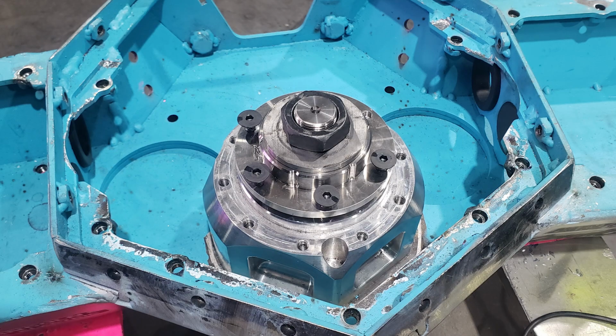So, my face, when this all happened, that is a meme now, and, like, what do you do? Every single thing has gone wrong in what was supposed to be our breakout season with what was supposed to be an improved robot. Well, what we do is, we get our McMaster order, and we try all 3 nuts, and we select the one that has a brass set screw that deforms into the 17-4 PH threads, acting like a small metal lock. And then we get ready for the next fight.